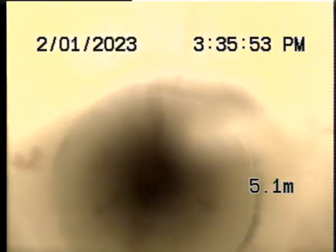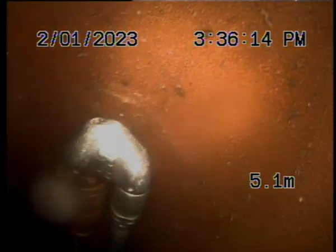Alright, so we're down the vent. Let's go back from the start here. Use the locator — try and locate that. This is the bottom of the vent; we're going straight from here, straight down, and then straight across. Picks up the toilet on the way. But then they've tucked it into this pipe here and it rolls down. Root getting in that join there. I might get a bit more chop on that. And then from there down — here's our locator.